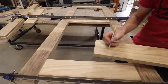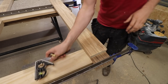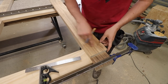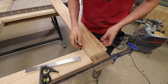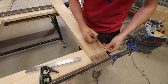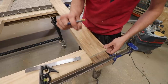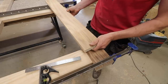And at the bottom here, one of these is a bevel. So the top side of this, where everything's square, we could just cut from this edge through with a square cutting saw, or we can square these lines over and cut from the top side. It depends what type of saw you've got and what sort of finish it's going to do. I'm quite happy to cut from this side because I'm using a round over bit as well. Any sort of tiny breakout from a saw blade will be removed with the round over bit.